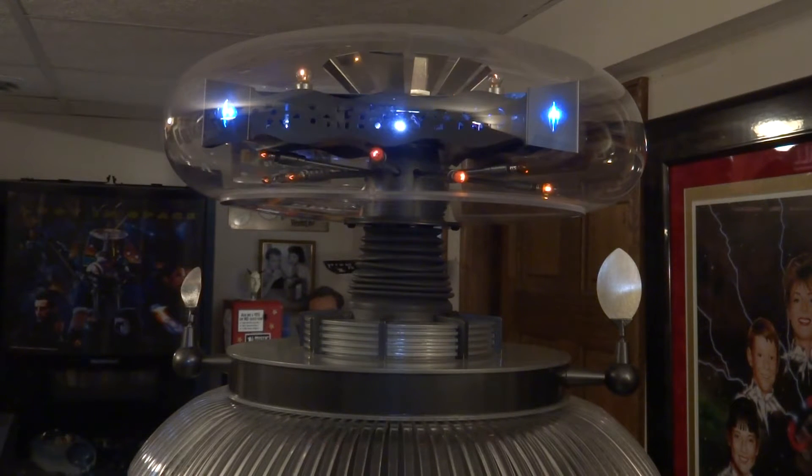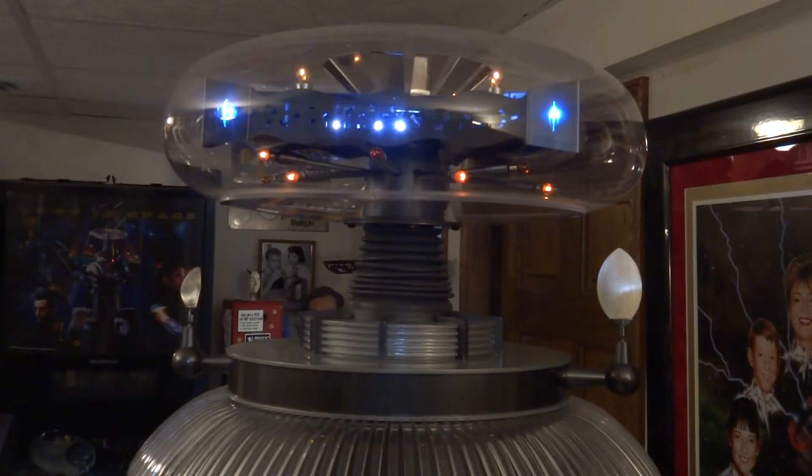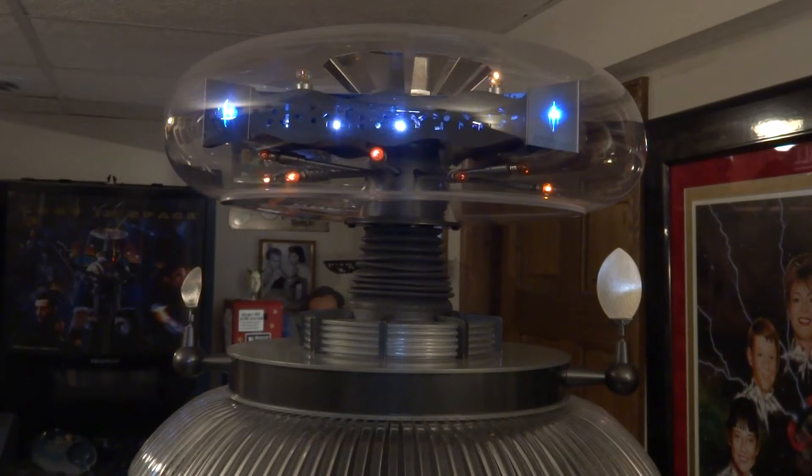Basically, what that is — you have a DC motor you're sending a voltage to. What PWM does is it actually breaks that voltage up into pulses, sends it to the motor, and by limiting or increasing those pulses, you can speed up or slow down the motor. It's a cool way to do it because you still get the full voltage to the motor — for example, 5, 10, 12 volts DC — but you're shooting it in bursts, so the motor isn't moving as fast but it's getting the full voltage it wants. According to a lot of engineers, that's the way to do it, instead of reducing the voltage to the motor, which on a DC motor is okay too, but sometimes this is an easier and better way.